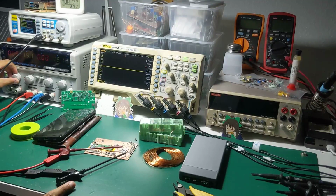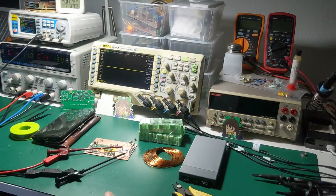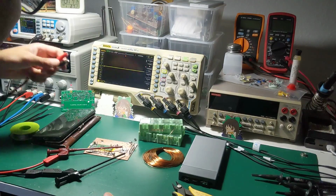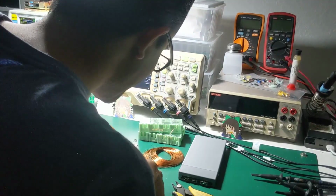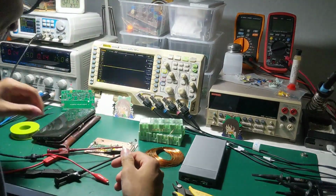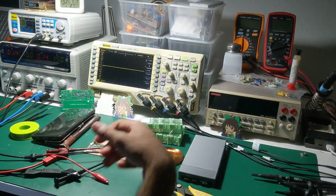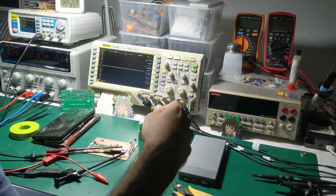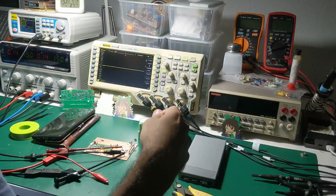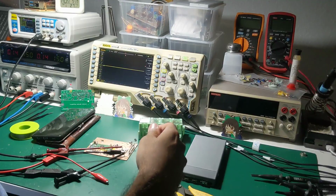Look, if I'm consuming 100 milliamps... Where's a pull-up? I don't trust this. Where's a pull-up? Shut up about the pull-up. You need a pull-up! I don't. It doesn't make a difference. It forms a voltage divider in the AC domain. No, you need a pull-up, otherwise it will go into that stupid thing. Yes, I literally designed it. You cannot dewilderize my circuit.